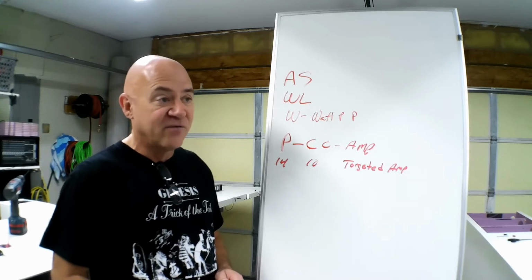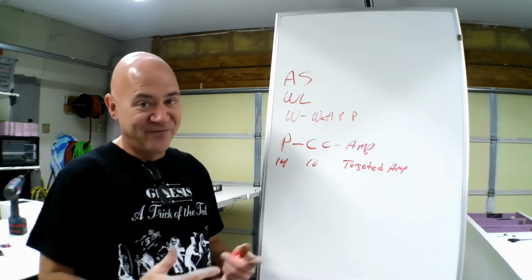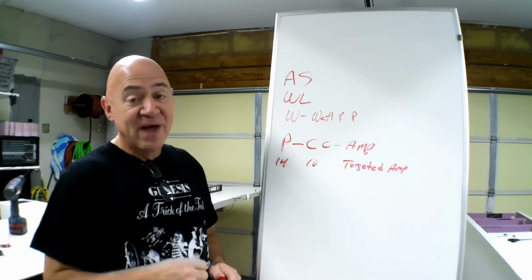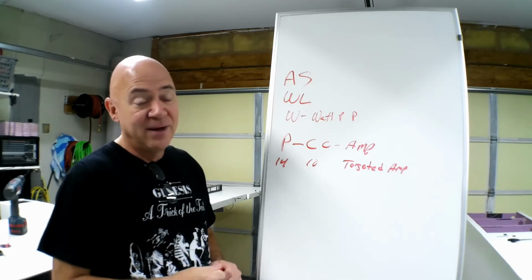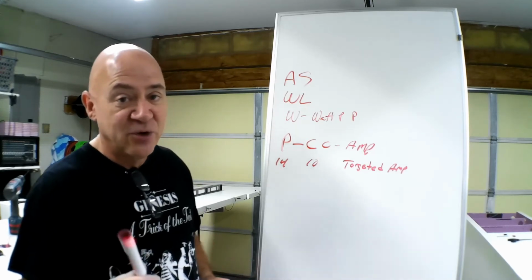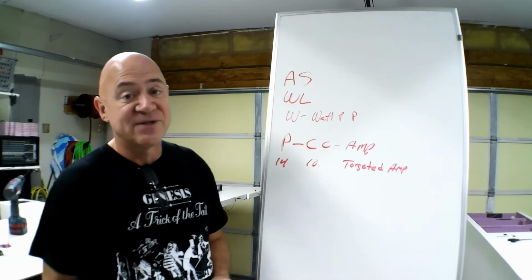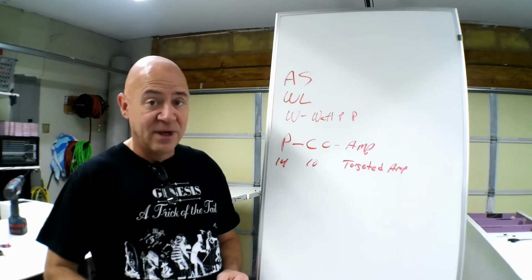Okay, now if you're buying a park flyer, which I've modified every airplane I've ever bought, I put the highest pitch prop I can on the plane, and then I go out, and if I'm overamping the speed controller, I just go up a little bit in the speed controller. There is one last thing you need to know, though, if you're modifying an airplane to a high pitch prop. Your plane is going to go faster, unless you bring down the cell count, okay?